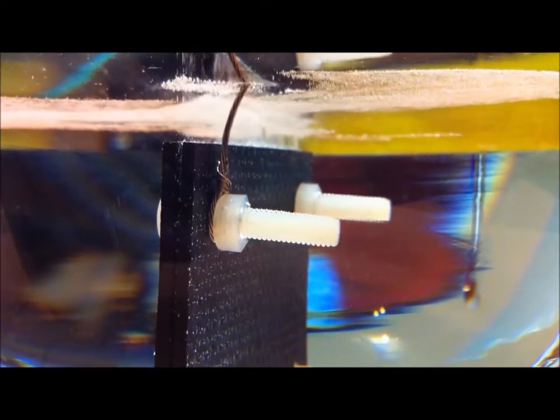We have gas production in plain water. Obviously it's got to condition itself just like a stainless steel plate would need to. You can see bubbles not only coming out from between the plates, but bubbles are actually forming on the surface of the plates. We'll zoom into that, and over time you'll see the bubbles form. So we'll just sit here and watch this.